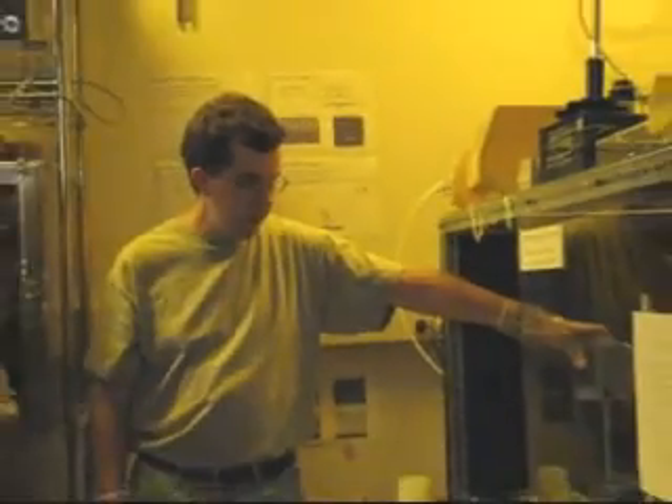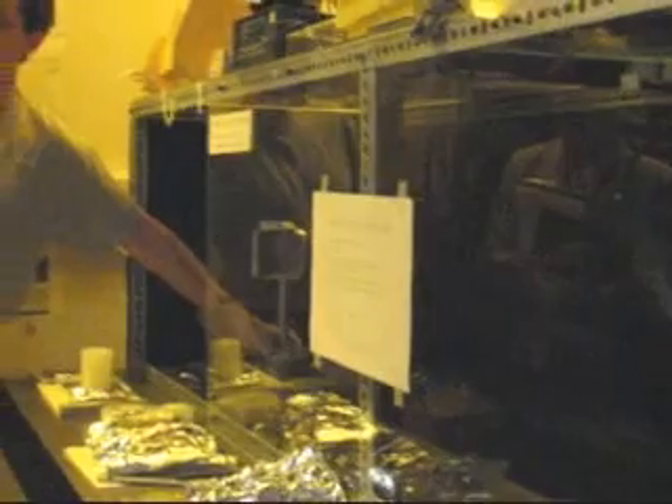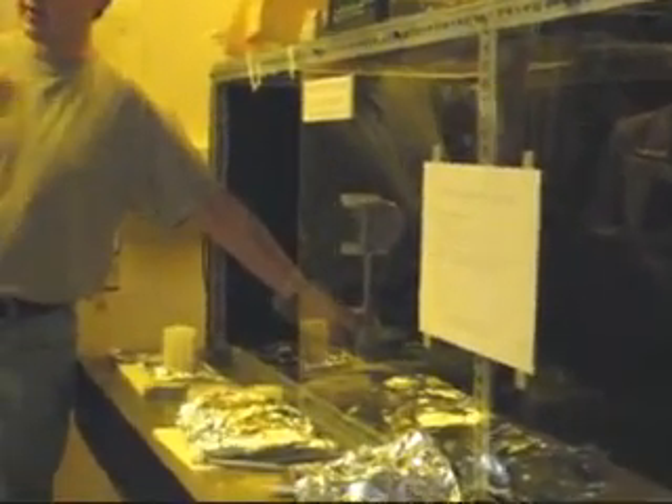Because we're using 325 nanometer light, the smallest pitch we can get to is half the wavelength, so we can get down to about 165 nanometers. It's very easy to adjust the system — adjust the period that you write just by rotating the exposure stage. That's something that's really nice because we have so many different people who want to do so many different things.